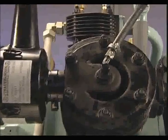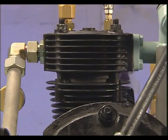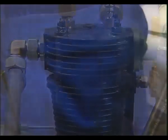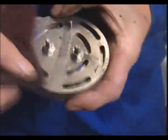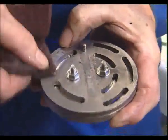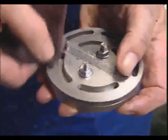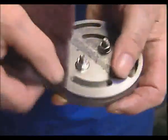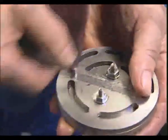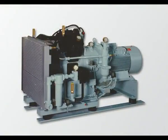The lamella or reed valves of the second and third stage require less maintenance compared to plate valves. They will still function even with minor incrustations or particle buildup. Normally, the reeds attain the same service life as the valve body, which because of its geometry cannot be reground or lapped. Therefore, attempting to exchange the individual reeds is not recommended. In the event that a reed is broken prematurely, for example, as a result of an effect by foreign objects, please contact our service.